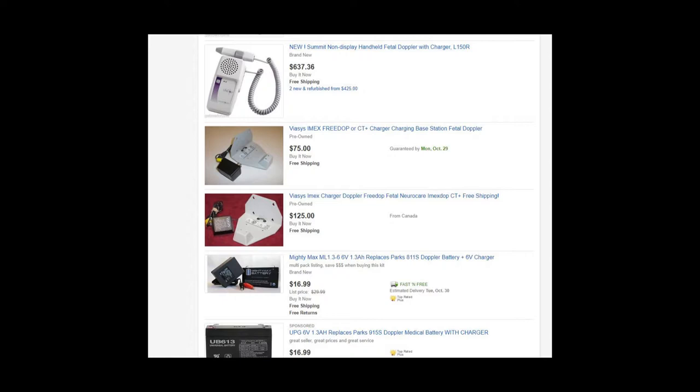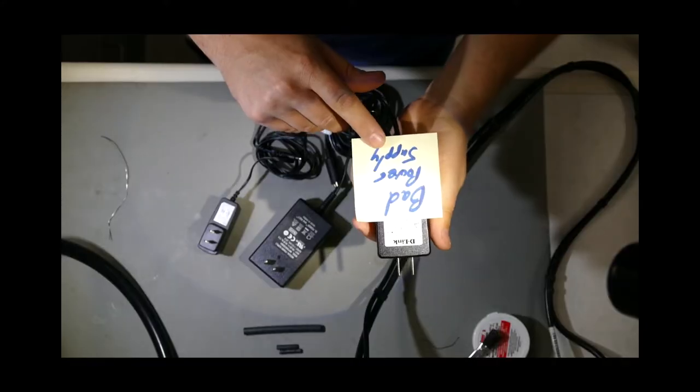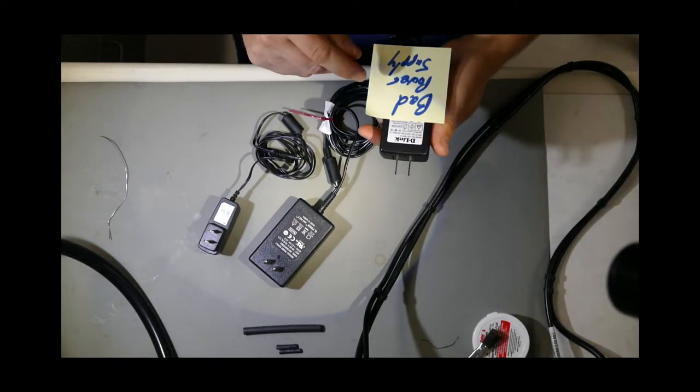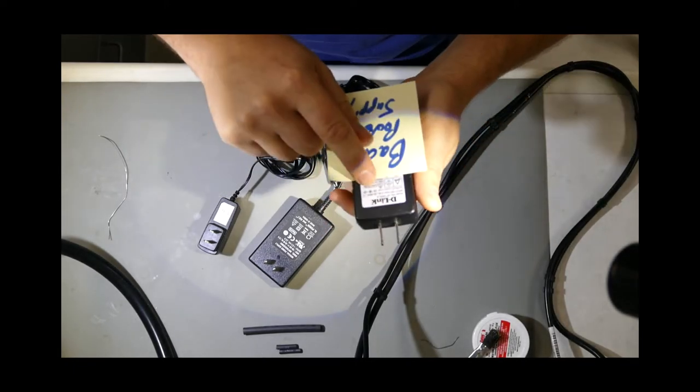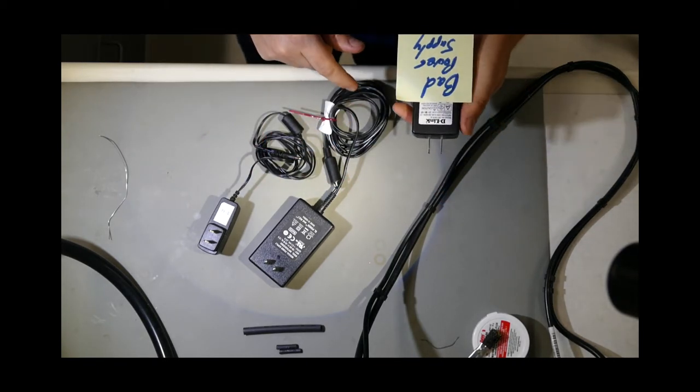In those cases, try eBay, or if all else fails, make one yourself. Don't attempt to make a custom external battery charger — there's too much minutia behind battery chargers to deal with, and you don't want to be liable. Use the pinout on the old power supply, or find the pinout on a photo online of the original power supply. Use the original output cord or power jack, either near the power supply or near the power jack.